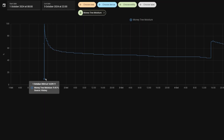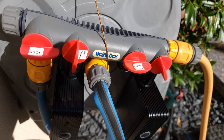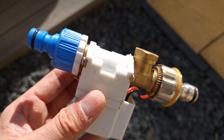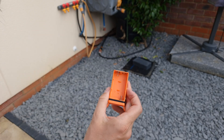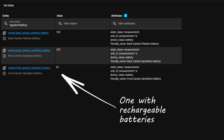This is great because it means you can control how much water you're using and therefore how much money you're spending on water if you're on a water meter. For potted plants it's easy to either underwater or overwater, so giving a consistent amount should help with that. I really love this new setup — I used to use a solenoid valve which needed a permanent power supply and didn't measure flow rate, whereas this one just uses four AA batteries which should easily last the summer season. I'd recommend changing the batteries each year just to be safe.